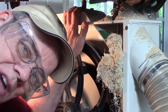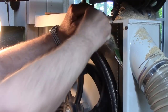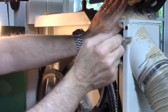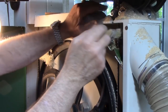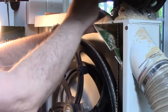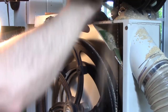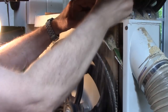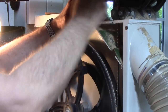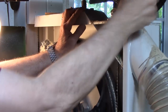Welcome to my shop — got a couple of quick tips on the bandsaw if you're turning green wood, otherwise it's liable to jam up. Now up underneath here there's usually some kind of dust shield, but all I find is it just collects wet shavings and tends to gum up in the bearing. So I keep it open and sacrifice just a little bit on the dust collection efficiency, and then I can see where it is very easily and just come in there periodically and wipe that stuff away with a brush.